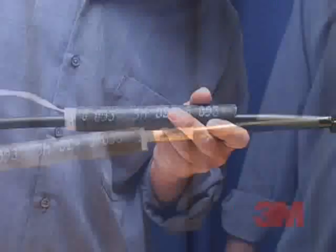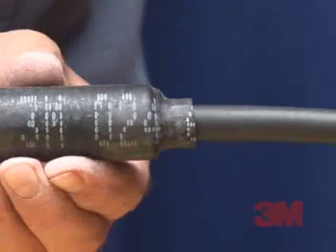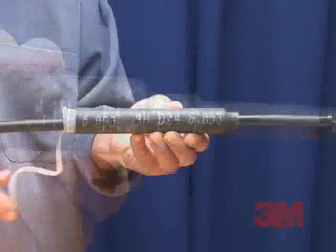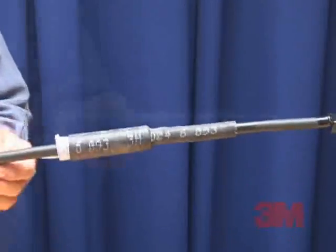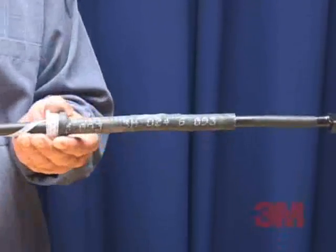Note: if installing on a lug, slide over the lug to the position indicated in the drawing in the instructions and unwind the core. Step 4: Pull the loose pull tab gently while unwinding in a counter-clockwise direction. A helpful hint: unwinding more than pulling allows the core to be removed more easily.